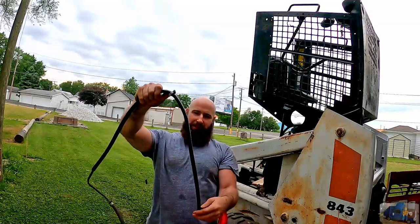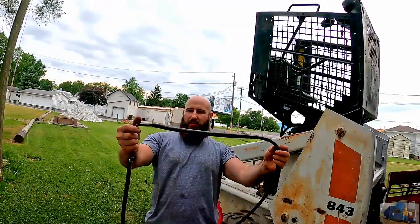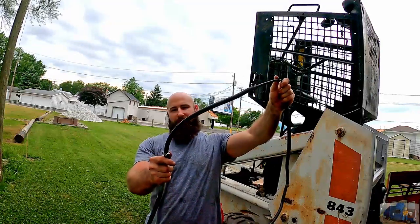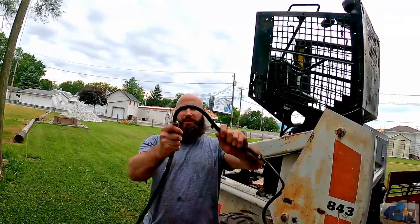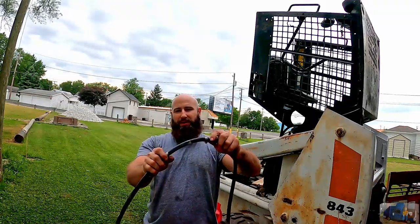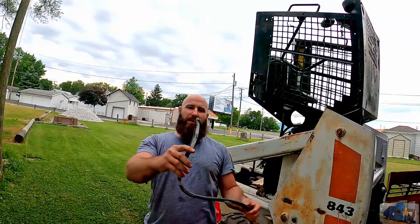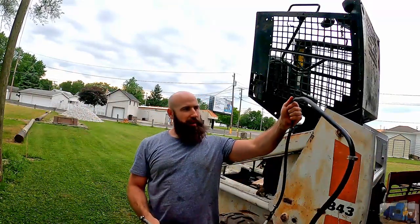Had a hose clamp at the top to set the height in the tank. Went over a steel elbow to go down the side. Another short section of 5/16 inch hose. This one's at least flexible. With some kind of pipe adapter, then I believe it goes up to 3/8 inch ID to that fuel pump they installed. So we're gonna try to replace this whole mess with one line.